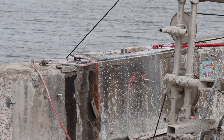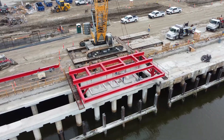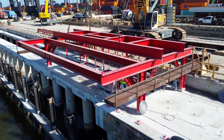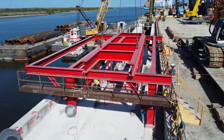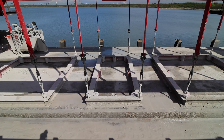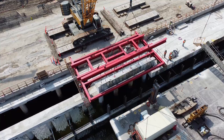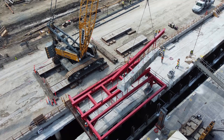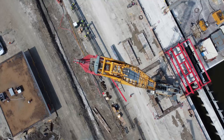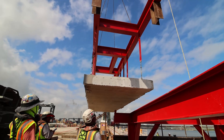The first step is to insert rods into the deck that the deck piece will be hung on. We need those rods because as the deck is fully cut, it will be suspended in air and we need something to hold it with. Next, a special device called a Spider is assembled. The Spider will hold a cut piece as it is freed. A crane cannot hold the piece directly because as the piece is fully freed, it will introduce an instant load on the crane, which is not good – dynamic impact is very bad for a crane. We need to protect the equipment and ensure everyone works in a controlled and safe environment. The Spider will relieve the crane from any dynamic impact. As the piece of deck is fully cut and released, the Spider carries the instant load, and then the crane lifts the cut piece.